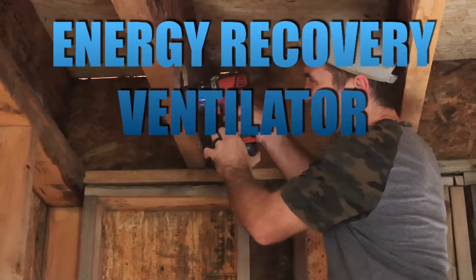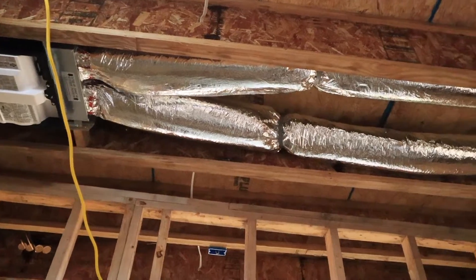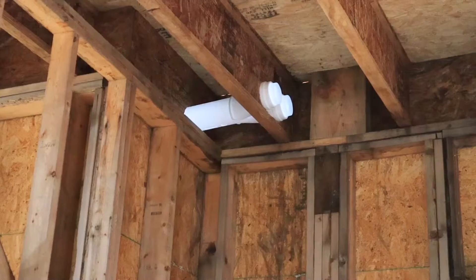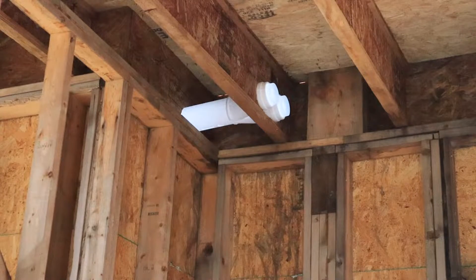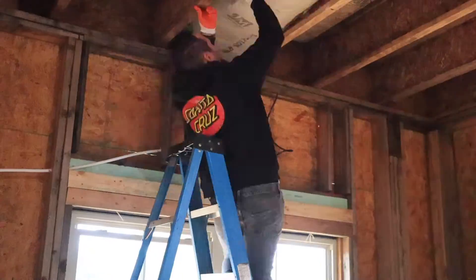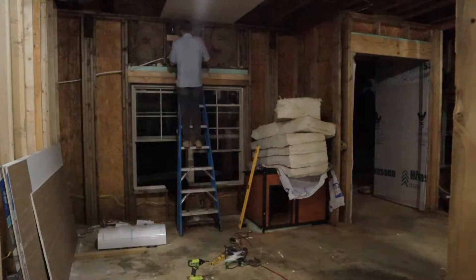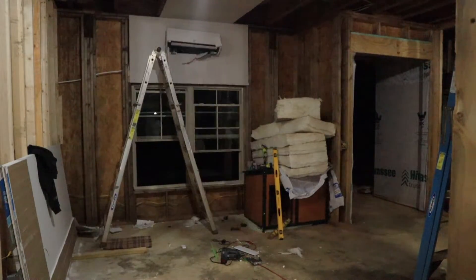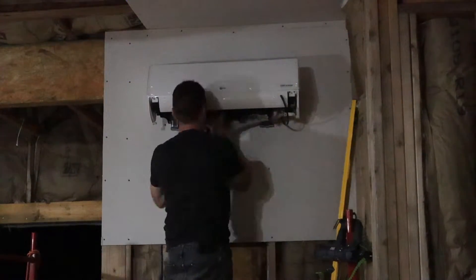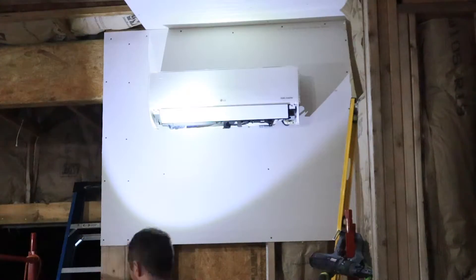We added an ERV, which was recommended from videos I was watching about mini splits. Mini splits are designed for really sealed-up houses that don't have a lot of leaks, because they circulate air differently than standard HVAC. The ERV brings in fresh air in a controlled way — it filters it, conditions it before bringing it in, balances the pressure in the house, supplements air when it senses negative pressure, dehumidifies, and removes stale air. The interior units were the last to go up — we put up sheetrock, fished all the line sets through, made the final connections, hooked up the condensation hoses, and buttoned them up.